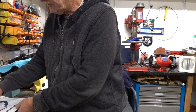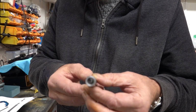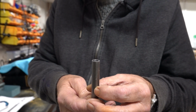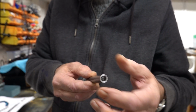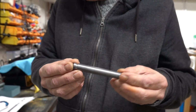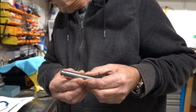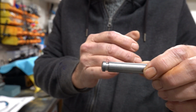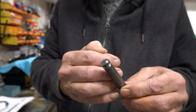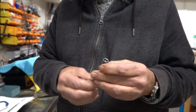Do I show you a snippet beforehand? I can, but I'm not going to show you the actual casting. That's a 5/16 hole drilled 9.5 millimeters deep to accept what I'm going to make out of phosphor bronze, little tapered fingers, 3 point some inches long, 3 and 7/8 long. In metric money, 98.4 millimeters, and that's exactly what they are. The groove in there and the end chamfered. There's 4 of those to make. So just a little snippet.